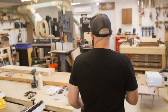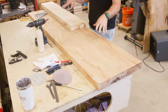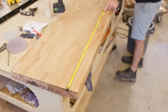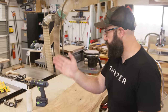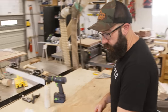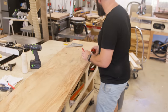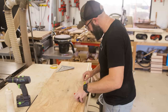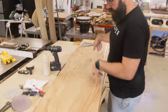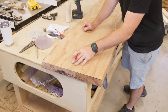I've got some extra pieces of wood from the same tree and I'm going to start breaking this down and milling it up to make the box for the cabinet. This bigger piece is 74 inches long — I'm going to break it down into three roughly 24-inch long pieces. So I'm doing a rough breakdown, marking at 24 and a half inches. I'll cross-cut these out and then rip them down into three planks roughly 5 and three-quarters inches wide, then resaw those down in half.